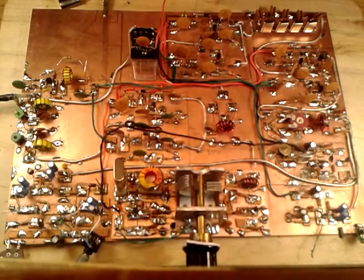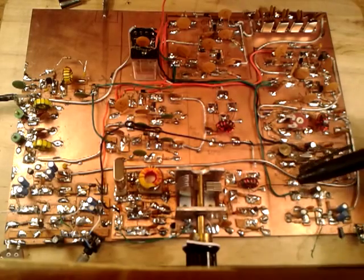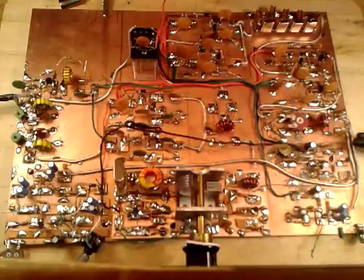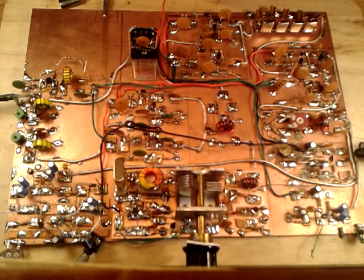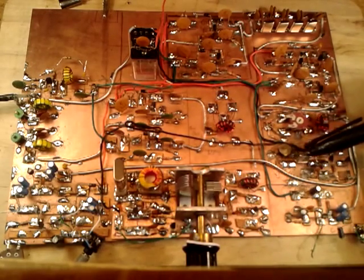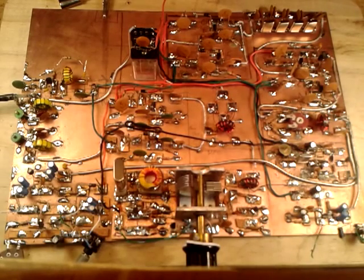The second stage I built was the mic amplifier, down here. After that we have the carrier oscillator, used both on transmit and receive, with a little 5 MHz crystal. It has an oscillator and a buffer amplifier, and I can move the frequency of the 5 MHz crystal a little bit — I have to slide it up to get it in the right position for sideband operations.